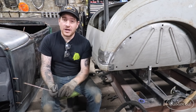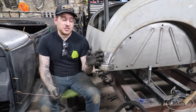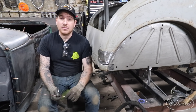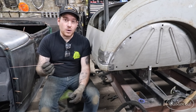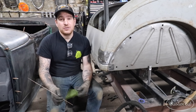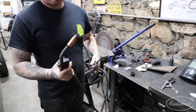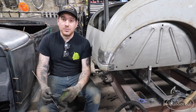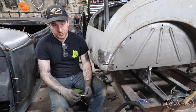The reason I like going smaller is you don't want filler wire that takes more heat to melt than your base material, because what will happen is your base material will blow a big hole instead while you're trying to melt the filler wire. That does require you to feed more wire and be more conscious of the puddle to avoid blowing through. As an all-around filler wire for sheet metal work, I like to use .035 filler wire. You can take it right off your MIG gun or buy it in bulk — usually five or ten pound packs from your local welding supply store.